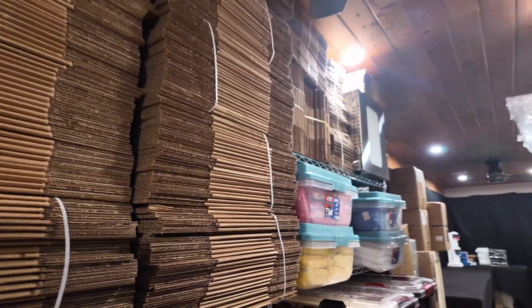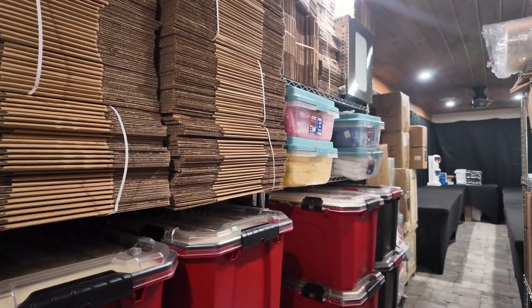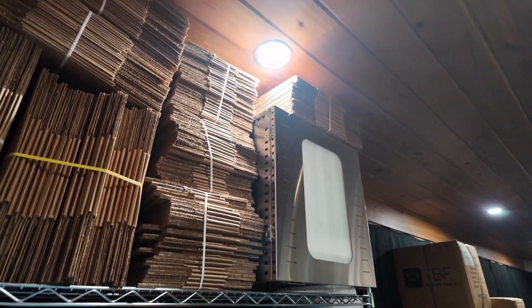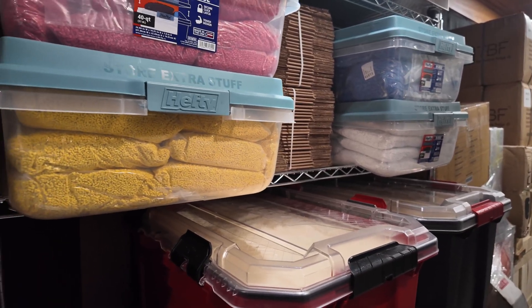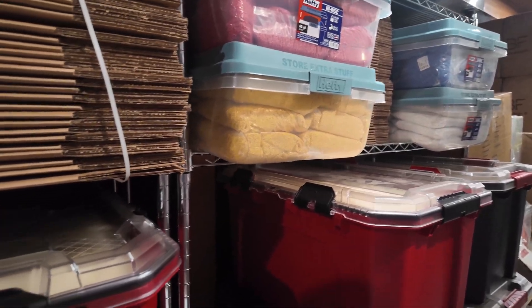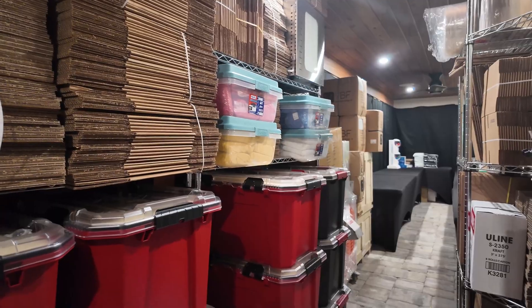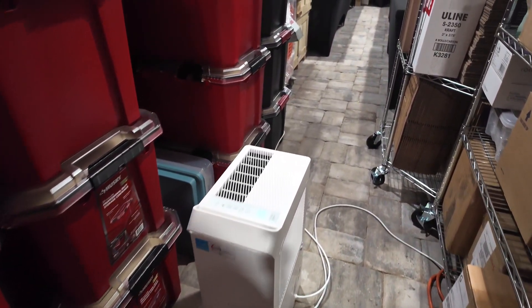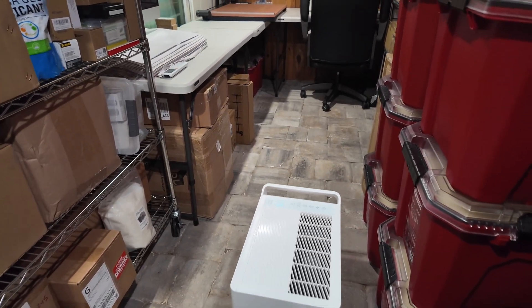I'm going to break everything down in great detail as I proceed — this is from the ground up, so you're going to see every single aspect of this business as I start it up. Up here is the dehydrator that will dehydrate the raw PLA. PLA by nature has some qualities to absorb moisture — it's not as high as other filaments, but it will absorb some. You want to get all that out before you start extruding it, and also when printing — if it has moisture you're going to have issues.